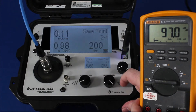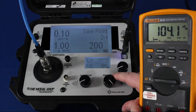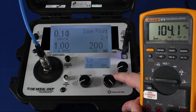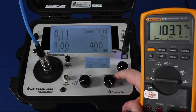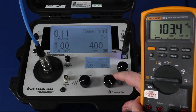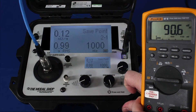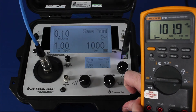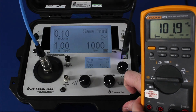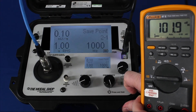I'm advancing from point to point simply by moving the frequency dial one click in a clockwise motion. At 200 hertz, 1G RMS — this is very helpful for repetitive testing. If you have to test a lot of these TrendMaster sensors, you can do so relatively quickly. Last test point, 1000 hertz — the high end of the range — 102 millivolts per G. So I can see that my sensitivity is within tolerance at every point.